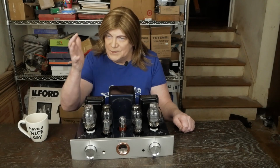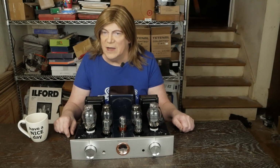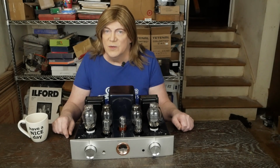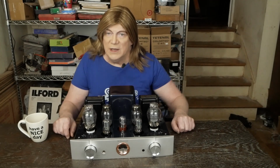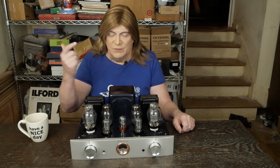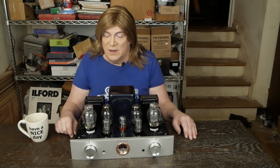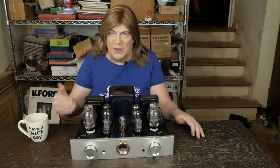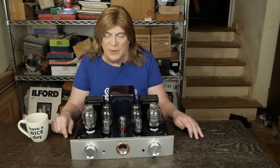I mean, the little, what is it, probably $800, maybe $900 now, Rysong A50's got better iron than this has. And this is being hyped and pitched as some kind of premium product where you're getting way more than $1,500. And at the end of the day, you're going to end up paying $1,500 for a chassis and a moderately okay power transformer. So anyway, I'm tired of messing with this thing, and like I said, I've still got a little bit of work to do on the feedback loop, trying to tame the high frequency kind of weirdness that it's got, but it's probably fine the way it is.